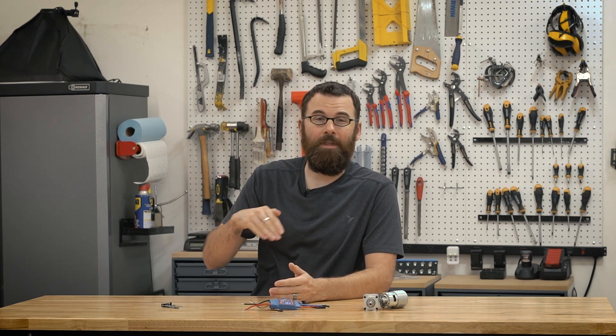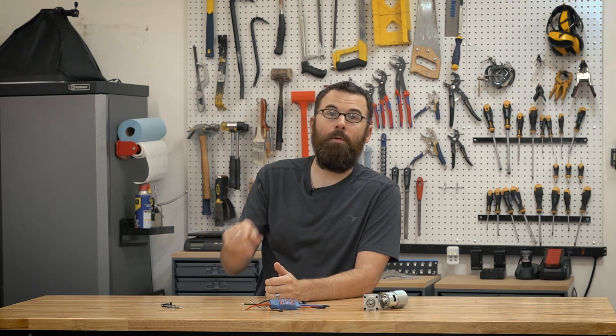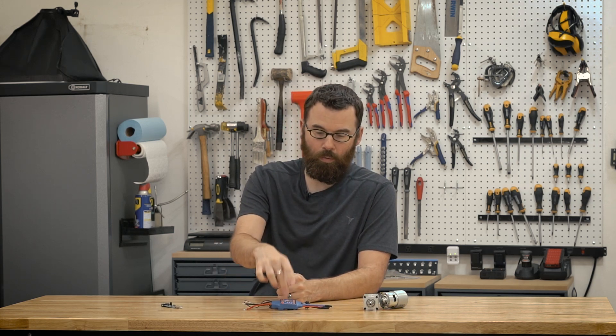It's a little more complicated if you're looking for an ESC you can flash with Simon K, because not every ESC is going to let you do that. If you check the links in the description, I have a table that a lot of people have collaborated on showing most of the common ESCs from HobbyKing or elsewhere that can be flashed with Simon K. The biggest thing to look out for is any ESC with an Atmega 8 processor — those can accept Simon K. There are some tricky details like whether the programming pads are accessible, but that table will help. I'm using the F series from HobbyKing — this is the F-60A. There's also a 70, 80, 30, 20, and 10 amp version, so there's a nice range in this series.